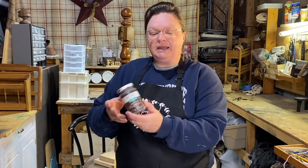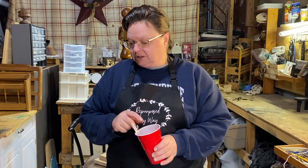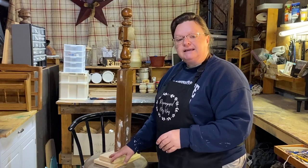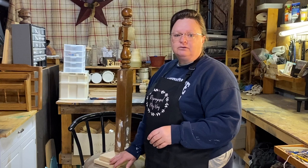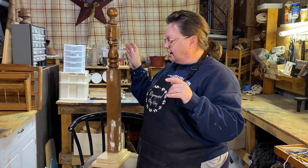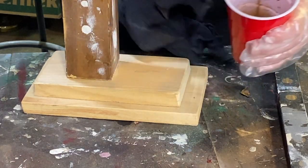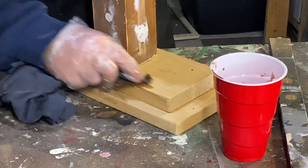I'm going to be using the Waverly antique wax and I mixed it with a little bit of water in a solo cup — it's probably about one part antique wax to two parts water. I just want to give the base a little more color to it, so when I sand it down and distress it, I want some of that darker color to come through. I mixed up just a little bit more than I'll need so I can use it later if needed. There's my antique wax watered down, and here's my rag — let's see how this comes out.